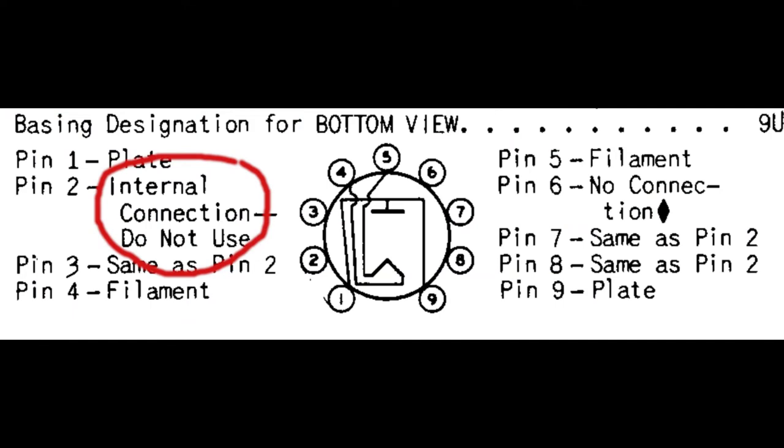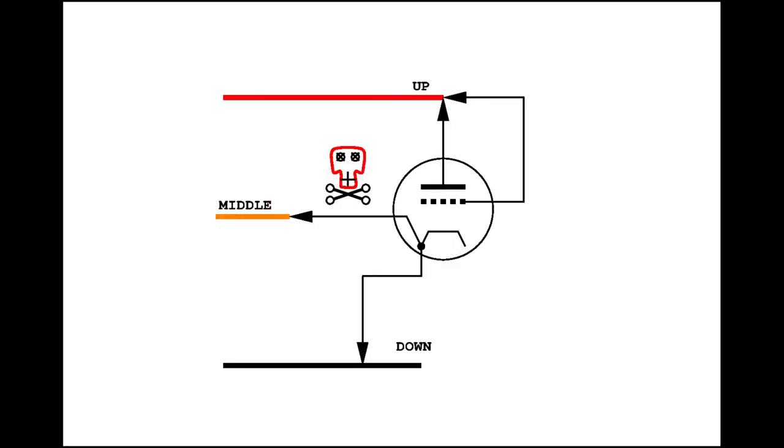Short circuit due to internal connections. The tube might have internally connected pins, which may be connected to any element, with no universal agreement between the different brands. The Heathkit tube checker family cannot leave pins open, and if a lever of an internally connected pin is put in the wrong place, that would provoke a short circuit during the test. The levers for internally connected pins must be put all to the same position, otherwise they would provoke a short circuit.